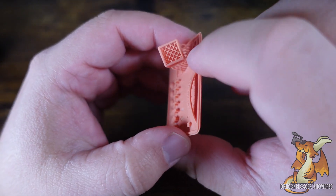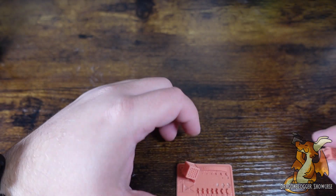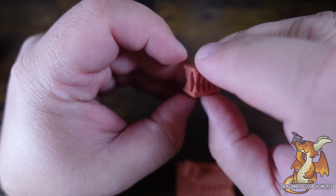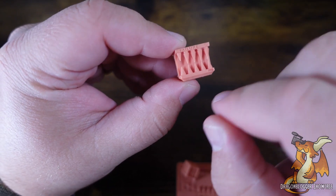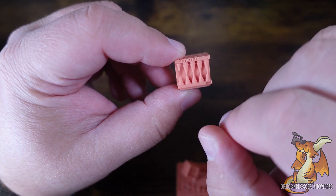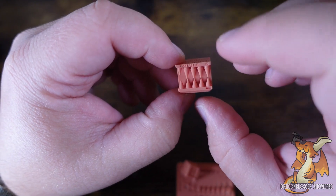Here's our lattice cube, which I didn't break off this time, and here is our cones of calibration. As you can see, we have full successes over here. On the back side, we have two failures that failed to fail, if that makes any sense. So I can definitely lower the exposure time by about one second, maybe one and a half seconds, to get these to fail.